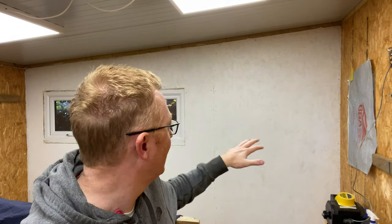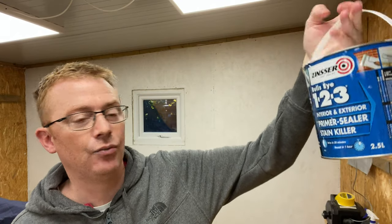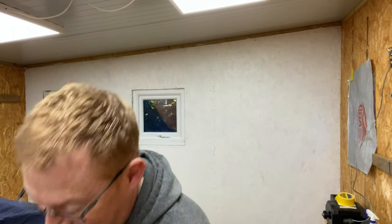Secondly, it drinks paint. All right, so just, it's not quite three boards, but if you think 3 8x4 boards, well over 2 litres of paint. It just kept soaking it in. And on the tin, finally, dries in 30 minutes, recoat in 1 hour. No, no, it doesn't, all right? Not on OSB anyway, because you've got to get such a thick coat of paint on it, a few hours. So I left it in the end. I thought, right, I'll come back tomorrow.